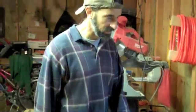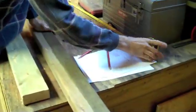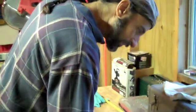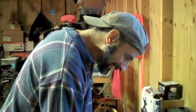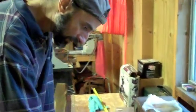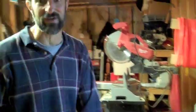We got our lengths on this little piece of paper, which you can't look at. We're using the metric numbers — it's way more accurate and a lot easier. For our 24-foot dome, we're cutting 30 A struts at 1.275.